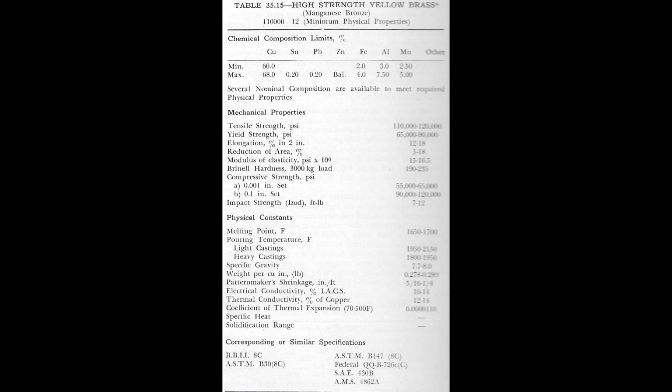They are relatively easy to cast but have high shrinkage characteristics, and consequently careful consideration must be given to gating and risering systems. They are not subject to heat treatment, but retain their unusually high as-cast characteristics with little or no difficulty as long as attention is paid to chemical composition. In other words, don't skimp on the copper, zinc, and lead, and so forth.